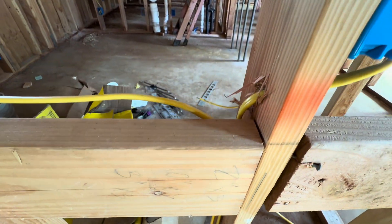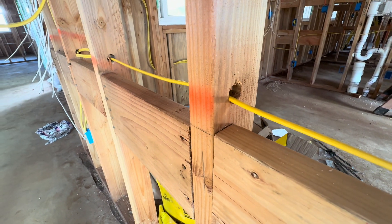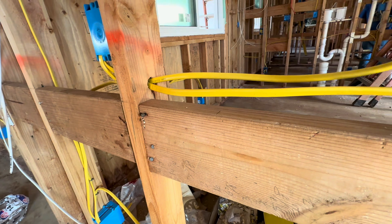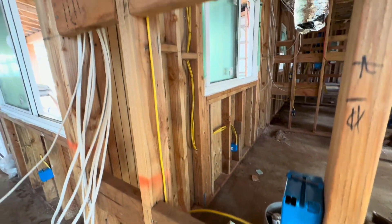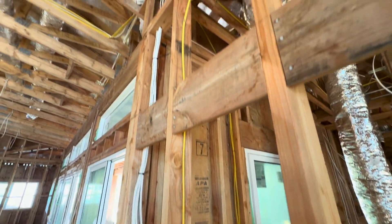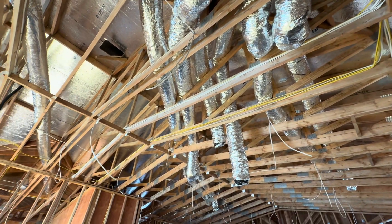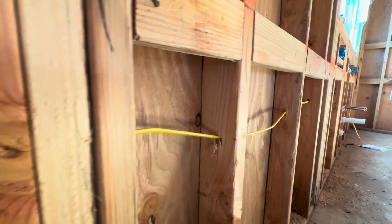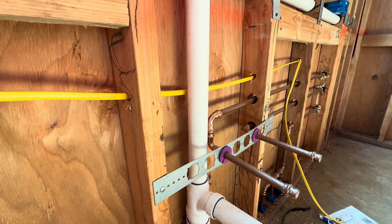In order to get through these studs, I'm going to copy what the electrician has done — with a spade bit or a paddle bit, you drill a half-inch hole horizontally through the studs and pull your wires through to the blue boxes. When I'm sharing the wall with an electrical system, I try to stay one to two inches away from these yellow or white Romex wires. There's an electrical hum on these that can theoretically interfere with the Cat6. All of the wires go back to the closet, and I try to follow what the electrician did, drill my own holes next to his, and pull my Cat6 through. Everything eventually ends up inside that electrical closet.